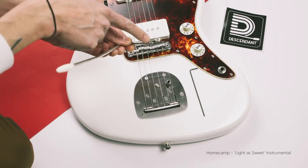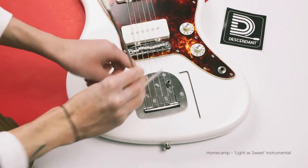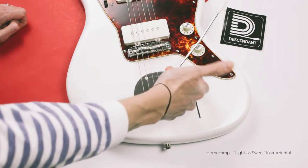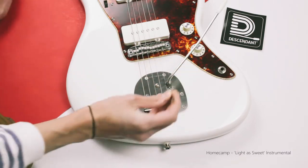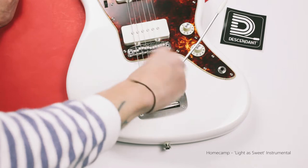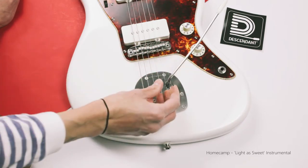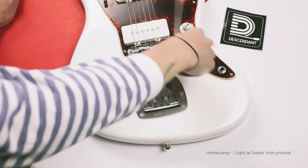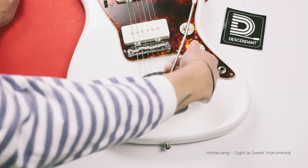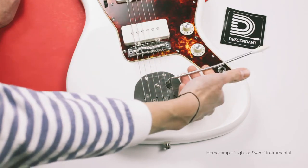The key feature really is that the arm itself has got a flat side, and what that's for is that once you've adjusted the arm to the correct tension, you put it in one position but it'll always be locked in place. To choose that, you grab your allen key and tighten it — I'm going to go tight, tightest, all the way just to show you the example. So that's fully taut; the arm's a little bit stiffer, but you'll notice it'll only remove in that one location — if I've got it here, it won't lift up.